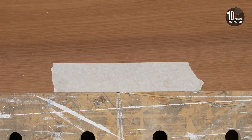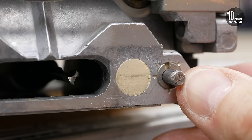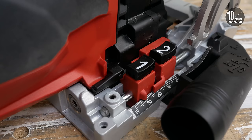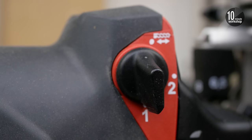In use, all three machines can be aligned against pencil marks, but the Festool and Mafell have sprung pins or paddles that let you register off the side of a workpiece without measuring or marking. The Lamello lacks this feature, but in practice it's easy enough to simply align the side of the fence against the edge of the workpiece. The Dowler now also has two presets for the depth of plunge. For example, if you're using a 40mm dowel with 18mm boards, you'll need a 15mm plunge into the face of the board and 25mm into the end — you can simply set them up as presets and switch between them as needed.